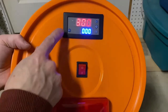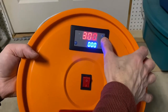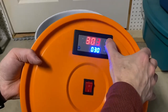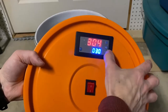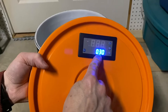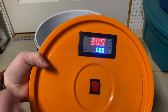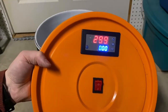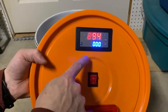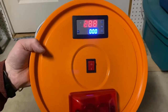The timer circuit goes on with a reset button. Press once on the settings and we can change the timing — this one's in seconds. This is the timer that the power goes on for when we turn the system on. The system counts down; when it reaches zero, the power is applied to the load, in this case the alarm. This second timer is set for how long the load stays on.